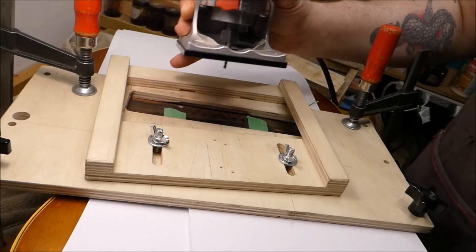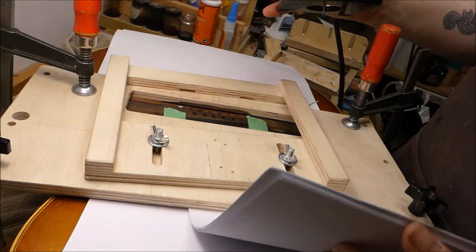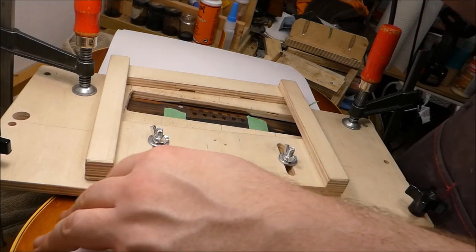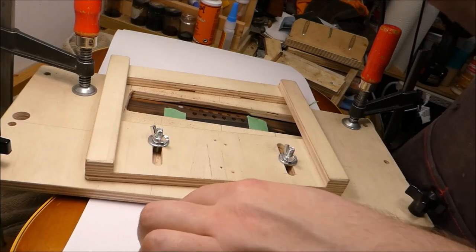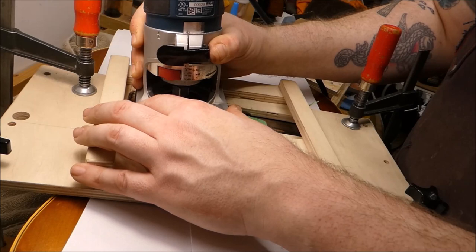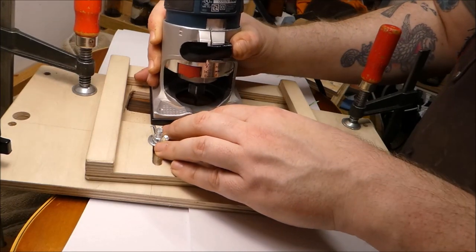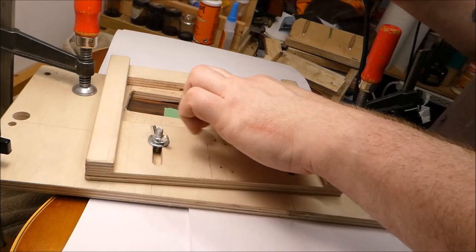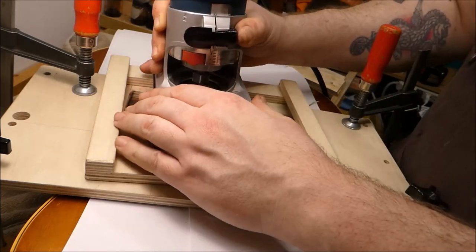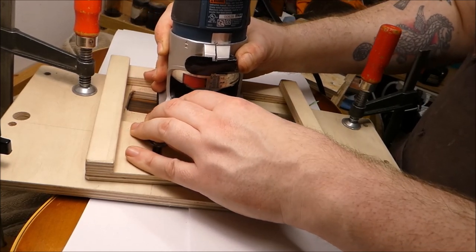This is the largest bridge I've ever tried to do this on. In fact it's so big it doesn't fit in the tray of my slotting jig. But I managed to level things off using stacks of paper. I have to take into consideration the thickness of a rather big pickguard there, and just the tendency for the jig to want to tip on the surface of the bridge. But I've got it down — it's locked in secure. I've set up the bit here. We'll basically take off the plug material to the back edge of the original slot, which I think is as close as I'd want to get to those bridge pins on the bass side.